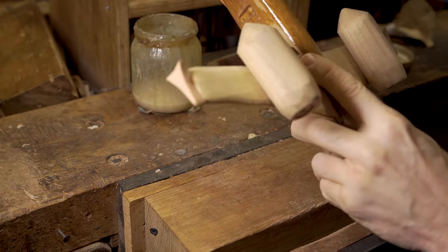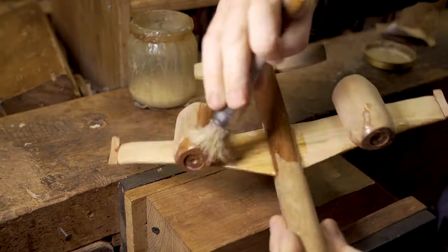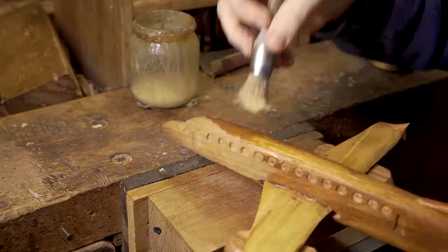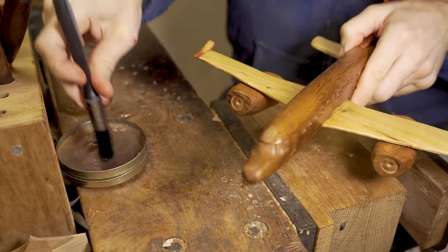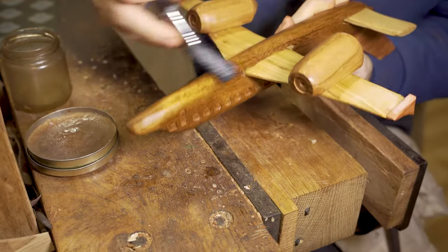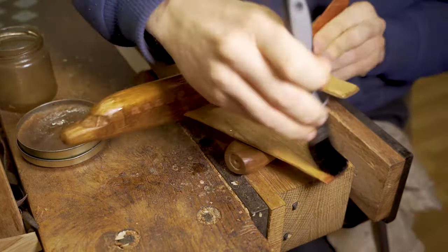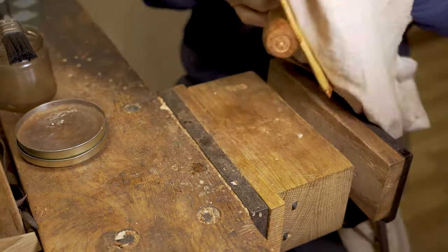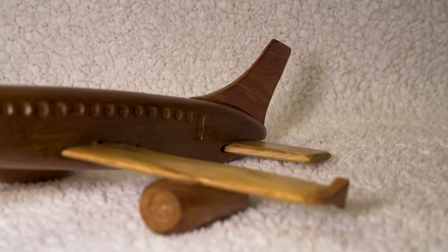The final part of the process is to add three coats of shellac sanding sealer, rubbing it down in between each coat. We then add a finishing layer of linseed oil mixed with beeswax — dab the brush in the linseed oil, then rub it on the beeswax and add it to the project. It just brings things out and leaves a nicer finish.